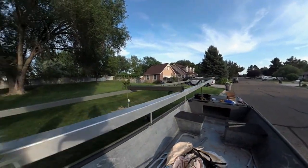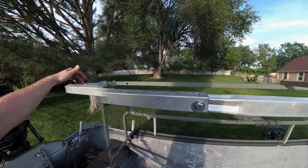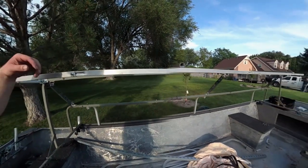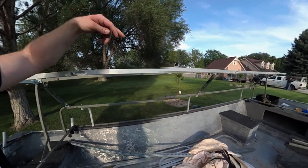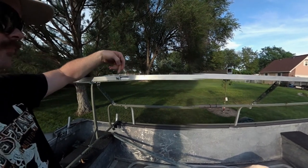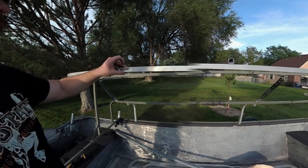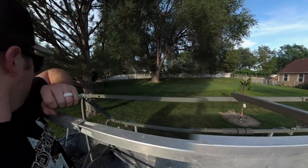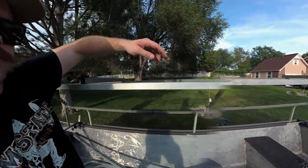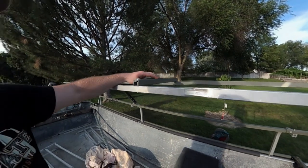So what we did is we took these pieces of aluminum, we took a pipe bender, we bent them to a 90-degree angle to fit these pipes into each other. Gary took a 1/2-inch piece of steel and he laid it on there and hammered them in. So it crimped those edges, and we did that 3 times here and here. And then these are for support.